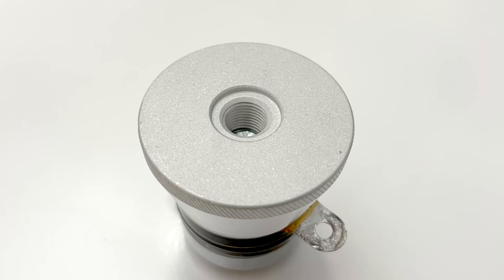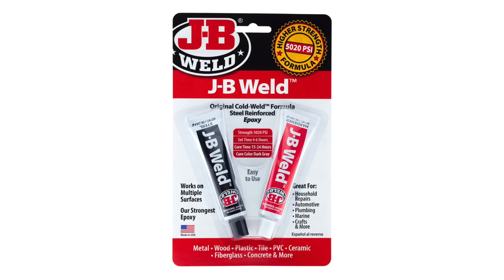The transducers were already cleaned and came with some sort of grey primer on the surface to help with the glue adhesion. I decided to use JB Weld, which is a very strong epoxy adhesive. I thought it might make more sense to use a silicone adhesive, as they have some flex and adhere to smooth surfaces incredibly well. But everywhere I looked, people seemed to be using solid epoxy, so I decided to do the same.